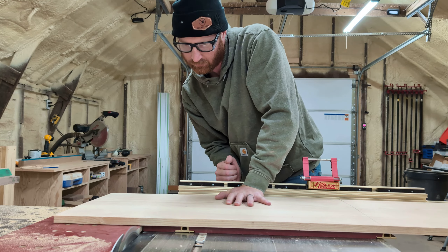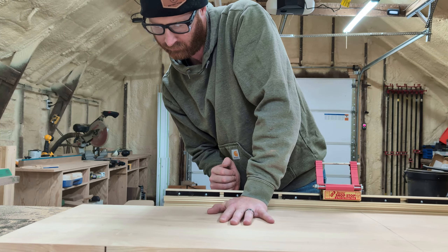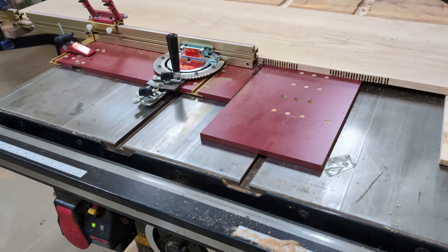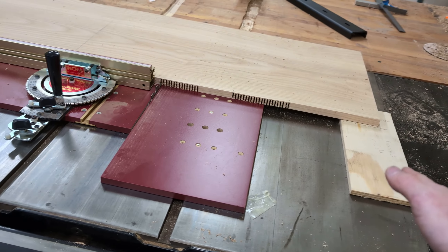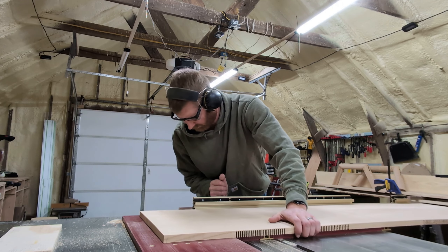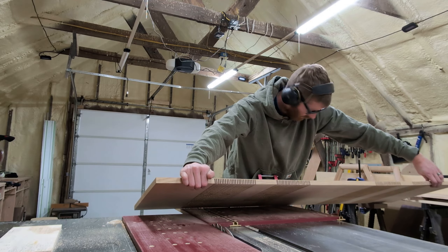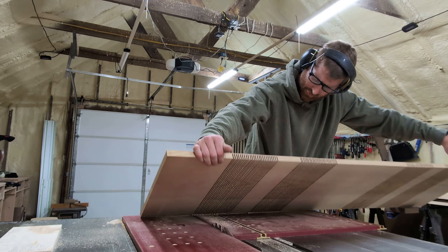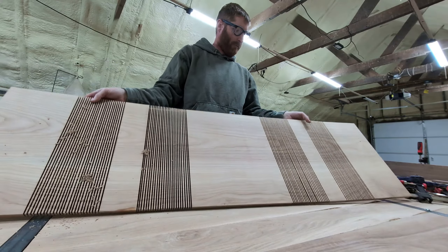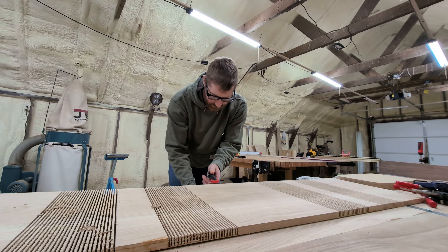When I did my test piece I used my track saw but I didn't like how that was starting to kick back over the course of all those cuts, so I figured my table saw with this sled would work a little bit better. It did to a certain point, then it started to droop over the edge because of the flexibility between those curves. So I had to put in a couple supports and then at the far end I ended up flipping it side for side and finishing off the last bit. Then I carefully transport it over to a flat workstation and make the attempt at actually bending this into my forms.